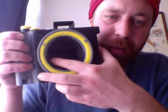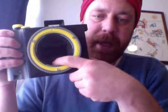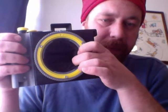If you want to trim it more than a millimeter or 2, you can either add more bottom surface layers, right? This counts as a bottom surface layer because it's printed against support. Or just trim it way the hell back and then seal it by pouring Plasti Dip or rubber or even a bit of glue in there, or some foam. Yeah, that should not get in the way. But if it does, hack it off for now and let me know. I will ask you some questions. I hope you have a $12 digital caliper from Amazon or better, and I'll release a second version of this that'll take all of the lenses. I'm sorry about that if that is actually getting in the way.